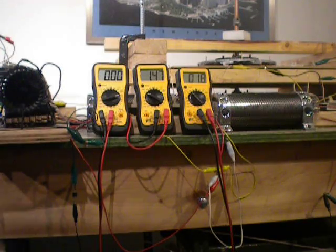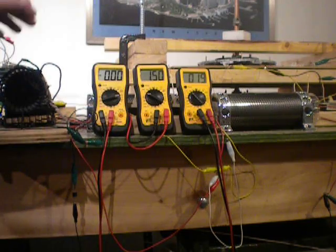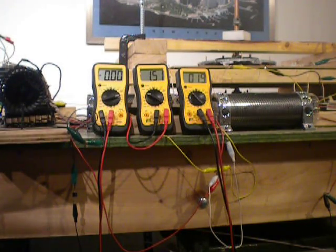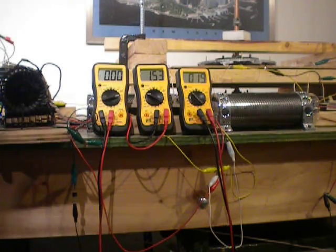Obviously we can't completely get away from that speed loss while charging the alternator. However, I do have one other thing I'd like to show everybody. You saw that the speed was around 2100 RPMs. One other way to reduce the drag on the alternator is to actually use a motor control and reduce this speed, thereby reducing the current needed to run it.